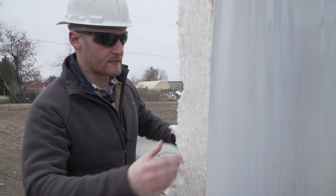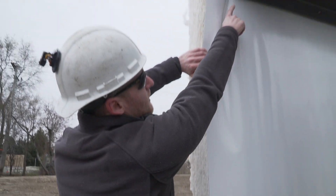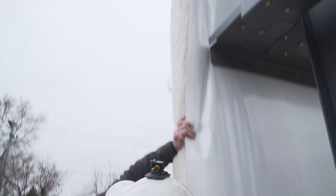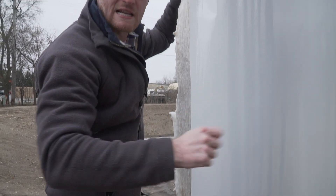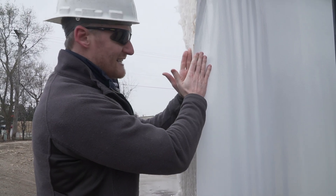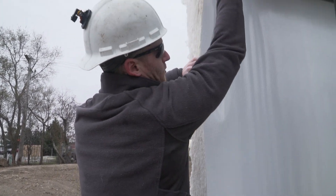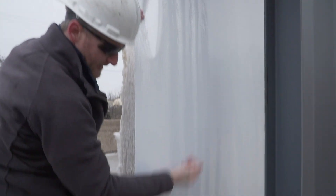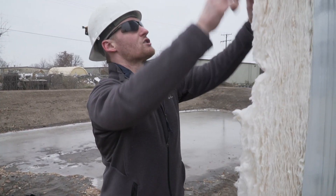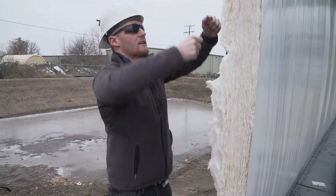Here's the side detail of our sheathing and insulation. We've attached it, running it all the way from top to bottom, and dropped it down. We had double sided tape that the guys peel off as they're running it down so that this sticks and they can grab that panel and put it up. We're screwing it to the purlins, dropping this down, pulling the double sided tape, taking these 36 inch sheets and putting them right at the bottom of this drip edge and sending it up to the top.